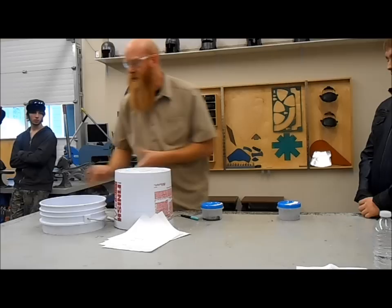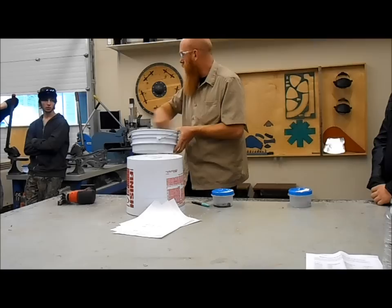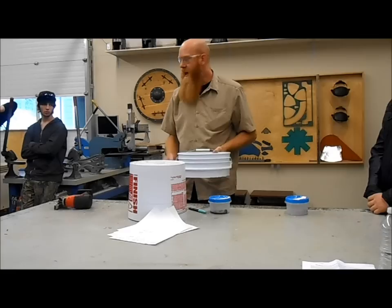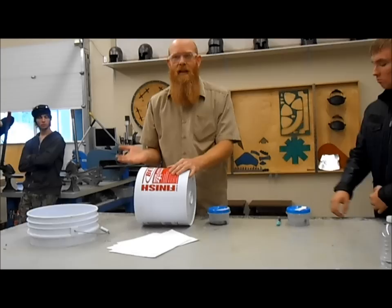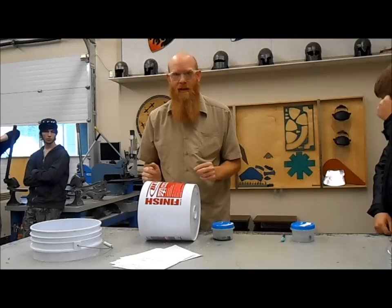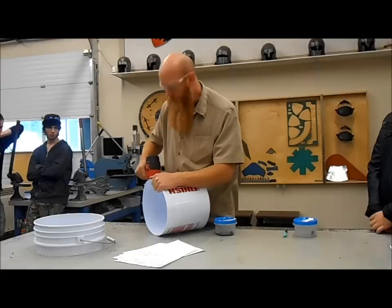When we make this classifier, we have the bucket and we need something to go inside of it to hold the mesh in place. So we're going to cut a second little band of this same plastic off here and use that band to hold the mesh in place. I make it fairly thick so that we don't have the risk of any of the chicken wire — that hardware cloth — those sharp points sticking up into the classifier, because it will draw blood.